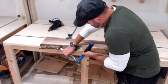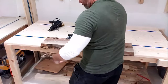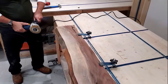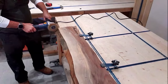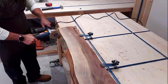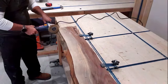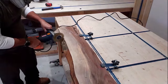Like all epoxy projects, before you do anything you've got to clean up the edges of your wood. Epoxy doesn't stick very well to bark, so you really need to clean it up. My favorite method is using my grinder with a wire wheel attachment. Sandpaper will work but it'll kill your hands, and as you can tell this takes it off like it's nothing — and it's pretty inexpensive.